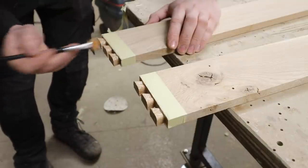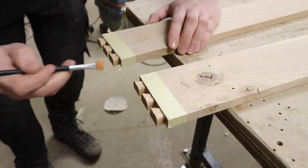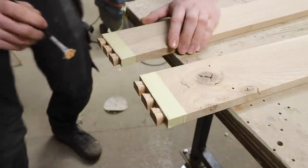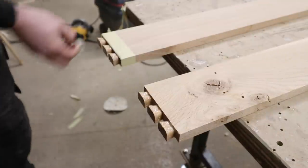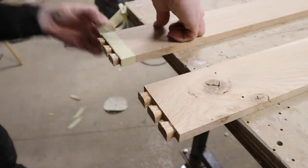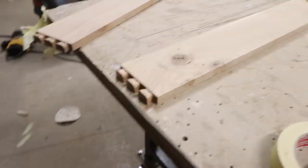If you're leaving clamps on your drawers when you're gluing up to get the joints nice and tight on these shoulders, you only need two sets of clamps, because after about 10 minutes, you can take your first set of clamps off, because the glue's dry. So no glue squeeze yet on these shoulders, and if we put it together right, you shouldn't get any at all. Lay that on the bench, and here you glue.